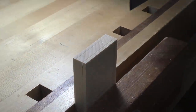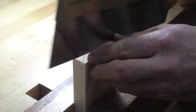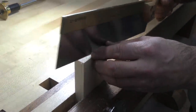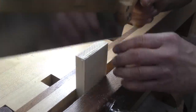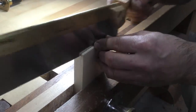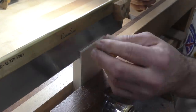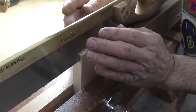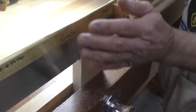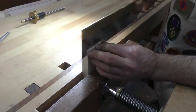Now that I have got that kerf established, that will guide the rest of my cut. What I can do is follow the line that faces me and simply tilt the saw on a bit of an angle. I can use the kerf here to guide and pivot from that to make sure I am following that line to the bottom. Then I am gradually going to lower my saw so that I am cutting parallel to the top of the board. Sometimes if this cheek out here is too thin, I will actually push against it and that will help make the saw track. Tracking is simply when your kerf is narrow enough that the sides of the kerf rub on the sides of the blade and force it to go straight. But if this piece is too thin, it is going to bend away with a little bit of pressure from the blade and you will lose that ability. So by pushing against it, it just helps hold it in place and you will end up with a much straighter cut.